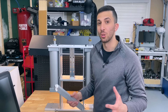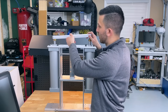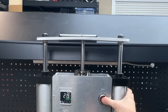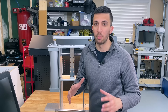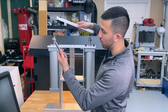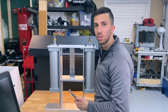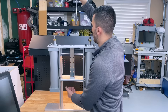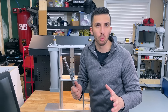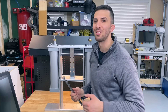Next, we assemble the top section, starting with this crossbar used to link the two pneumatic cylinders. This crossbar is two and a half times thicker than the one in our original injector video, which will prevent it from bending as it did before. The crossbar forces the plunger into the heated chamber to push plastic down through the nozzle. The extreme tolerance reduces plastic leakage between the shaft and walls for a much more precise injection.